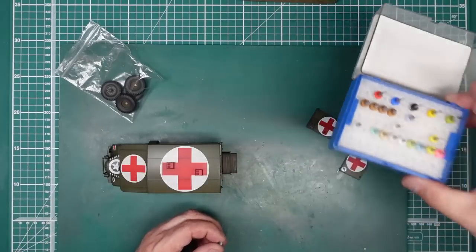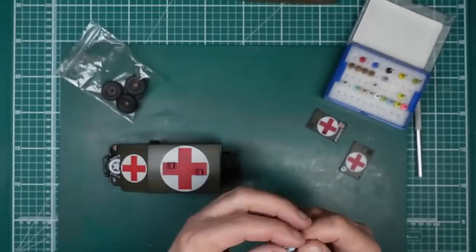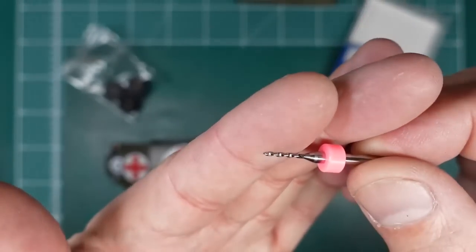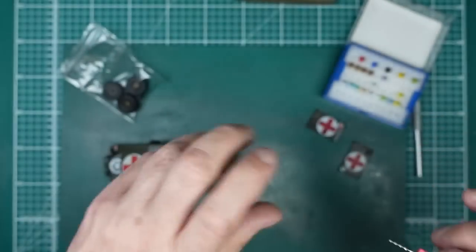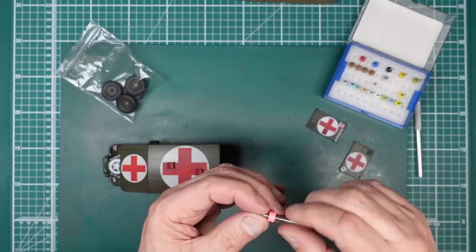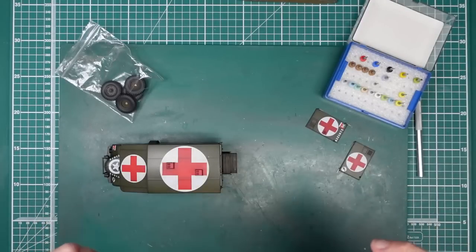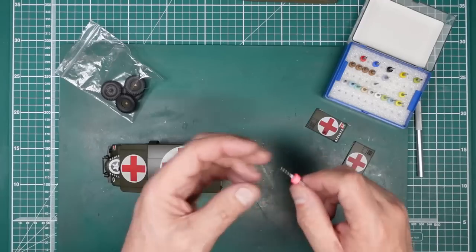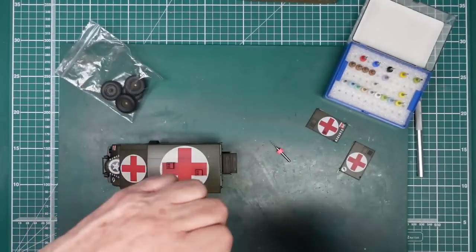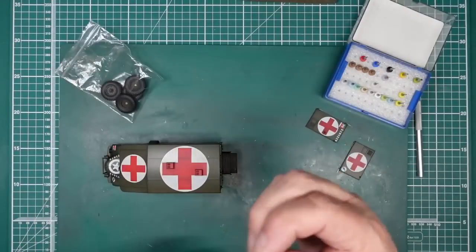They don't come in a box like this. But these things here, I don't know if you can see that. If I show you a bigger one, that'd be easier. They've got a very, very high helix angle. So when you drill, they want to go their own way. I guess they're fine with a tool, but when you're drilling them by hand, they want to sort of corkscrew themselves in. And if you are drilling something fine like that, you've got to be very careful not to split it open, because it's not trying to drill it, it's trying to screw it. And it's not, you know, a piece of chipboard. If you just put a self-tapper straight into a piece of chipboard, end on, it just splits it open, and that's what these will try and do.